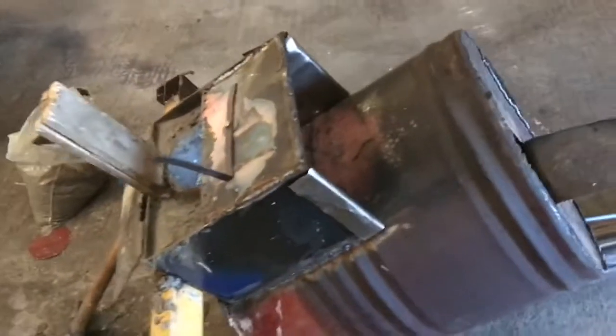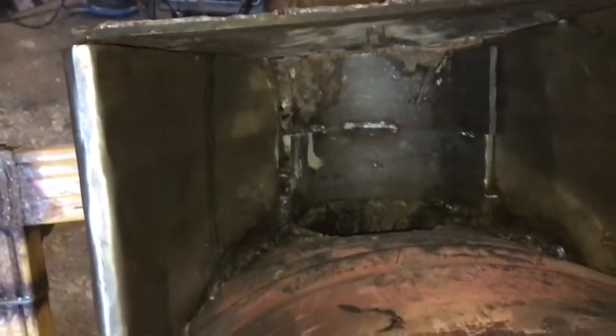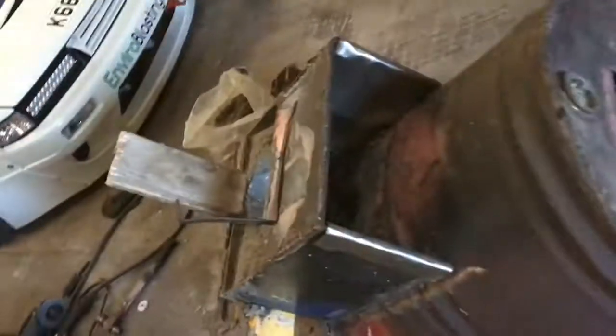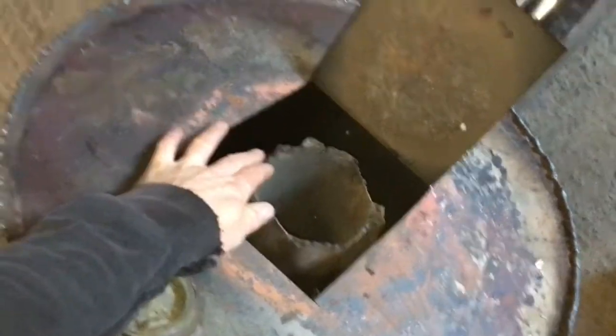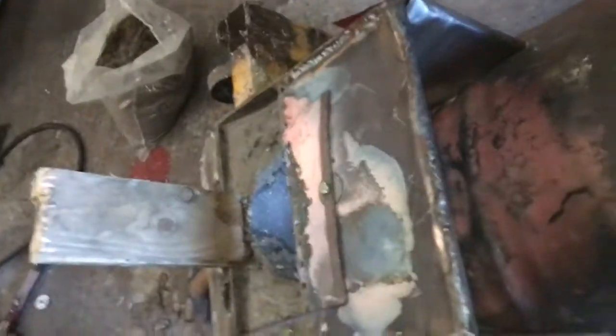It's actually going to work a little bit better. I decided to make a few modifications. In the hopper I've made it more like a proper hopper than just a box, and welded in a couple of heavy steel plates in the bottom that I'll drill holes through — that will give it an air supply underneath. I'll fill the void with sand and cement to insulate it a bit. Also, when I welded the pipe in it sunk down, so my air gap has shrunk to only about half an inch. I'm going to trim that pipe down to give it more of an air gap between the pipe and the top. I also forgot to put the secondary oxygen burn pipe in, so I'll do that now.